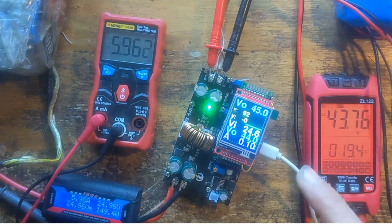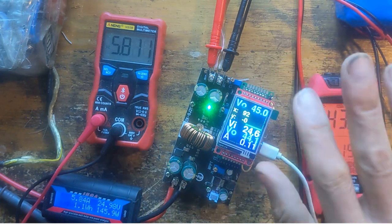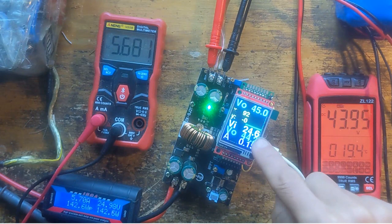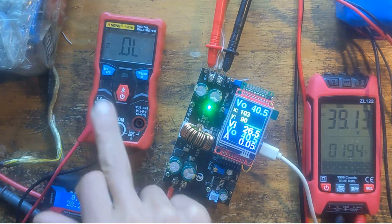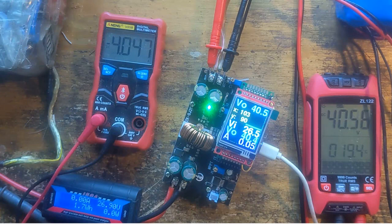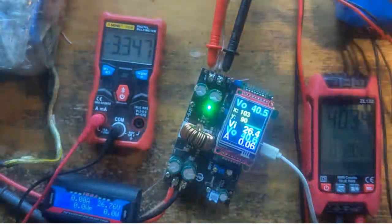The range here — I think I use a 1 kilohm resistor in between this potentiometer, giving plus/minus 20 volt. Right now for the touch I've set it to minus. Let's go to the absolute maximum; this will start saying it's overloaded. I think with this overload the voltage goes negative. The ESP32 is specified to go down to minus 0.3V, and it was only 100 milliamps. I put a 1 kilohm resistor before the ADC pin and it was even below that — but somehow I no longer see the ADC reading. The board is still working but that ADC pin is gone.